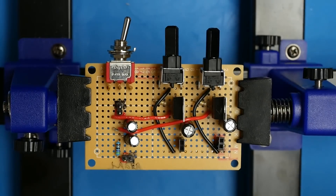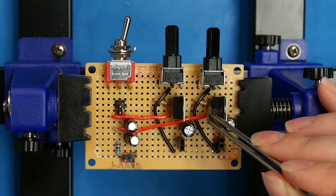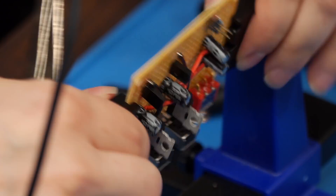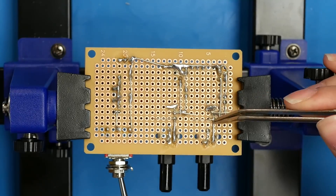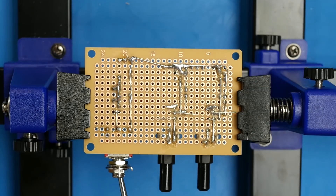I've decided to use a 100 ohm resistor, so I have it now between pin 1 and pin 2 of my LM317. I don't recommend doing it at this step — we probably should have done it earlier — but I wanted to show you my resistor trick. This end goes to pin 2 on that line, and this one will go to pin 1. Same over here — pin 1 and pin 2. Let's solder that up.